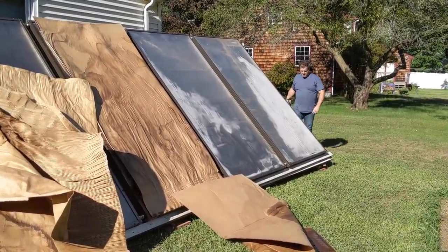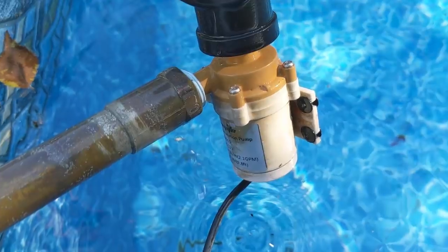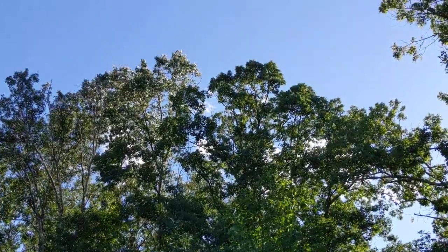End of the day making the last connection — we're actually just running this with some garden hoses for now. That's a 35,000 gallon pool. I didn't think that little pump was going to be able to push it across the lawn, fill up the panels, and push it back to my pool. We're talking 200-foot hoses on either side, and eventually that's going to be flexible PVC pipe. But we tested it and it's the end of the day — there's almost no sunlight left — and yet the water coming out was already 20 degrees warmer.